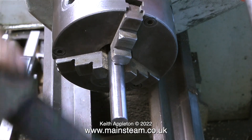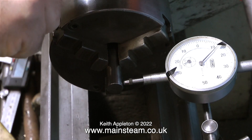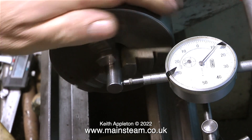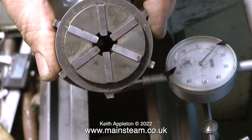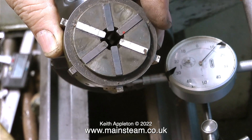Here is the piece of mild steel that comes with the kit of castings. A dial test indicator is an essential tool for the workshop — it allows me to check that my lathe chuck is true. It's quite surprising: you can put a piece of bar in your three-jaw chuck thinking it's accurate, then use the DTI to check the accuracy of rotation. It's far better engineering practice to use one of these.